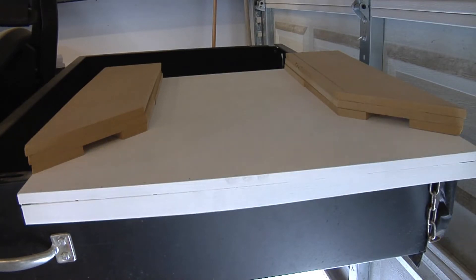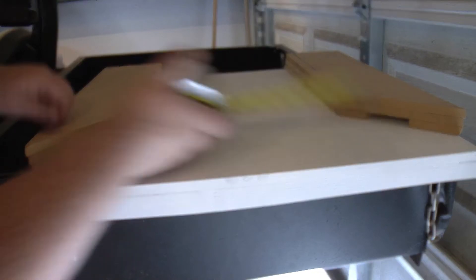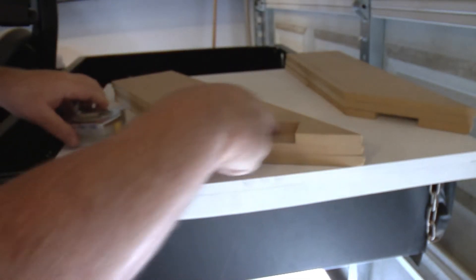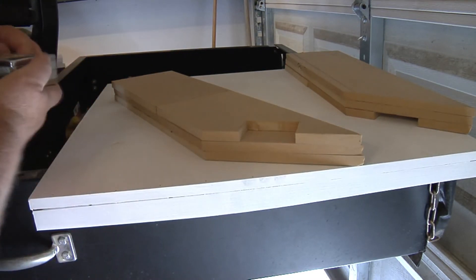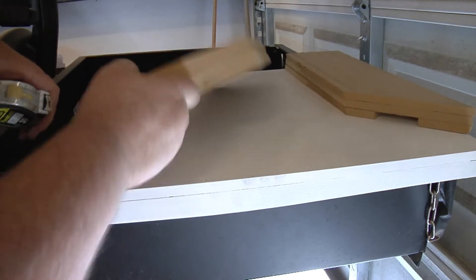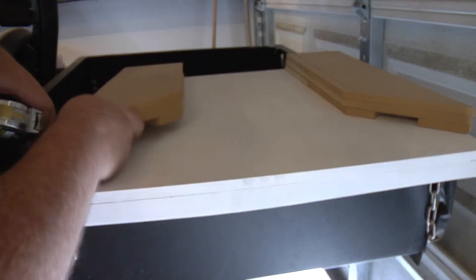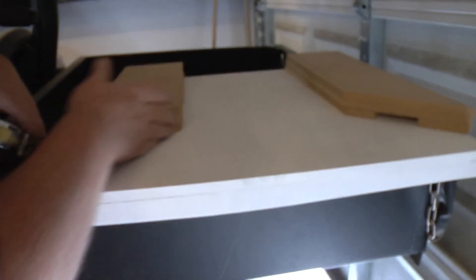I've been working on my side tables again. I got the slots cut out here in the bottom — them are two and three quarters each side. Just cut out your bottom pieces, just make a little square area so the coins and chips and stuff can fall through. See that's about an inch and a half deep — an inch and a half deep by two and three quarters. And that'll work on your side table. All this right here don't have to be perfect because the slider tray is gonna hide most of that. One thing that's gonna show is just the very top edge, and your pusher tray will come clear out to here, so all this front edge needs to be nice and pretty. We'll get all that sanded down and painted.